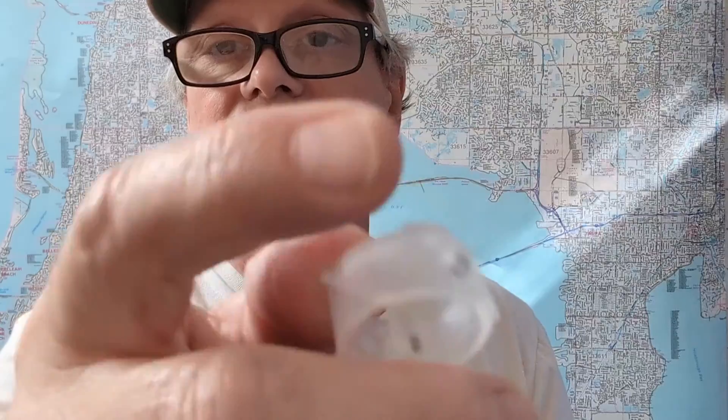It's kind of cool that they knew I had a problem with it before I did. I'd been using it probably for over a year before I got this email. The device measures flow with this impeller that's inside. This is the replacement kit — it's symmetrical, you can put it in either way. It has a little magnet on each side that spins through the collar, and I presume there's some type of inductive sensor. This is just a placeholder, and it included two replacement gaskets.